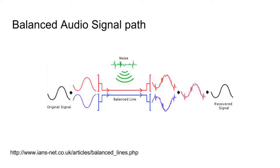At this point, the wanted signals on each conductor are both the same polarity or phase, whereas any noise is of opposite polarity. So summing the signals from the two conductors together reinforces the wanted signal and cancels anything unwanted, leaving a recovered signal which is very close to the original. This is known as common mode rejection, which means any signal that is the same on both conductors is removed.